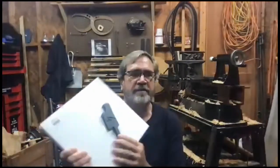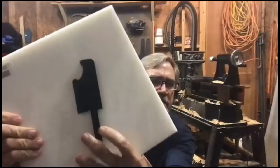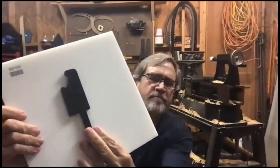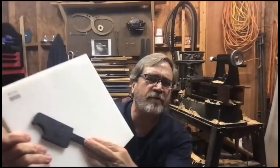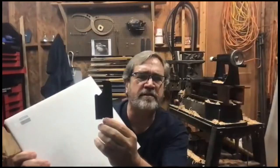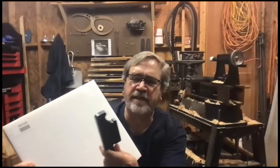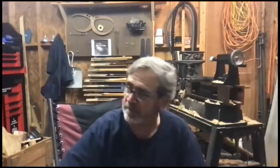Put it in front of this light thing. Is the 40-40 jig that Mike Bulat and I both bought one. We started emailing back and forth, and it's a pretty handy tool. It's about 25 cents worth of plastic, but it costs about, I forget, $25. And the real thing is the ingenuity behind the shape, and it works well with the Wolverine system. And every tool that goes into my Wolverine jig is a 40-40 grind. You think that might mean the same thing on all the tools.